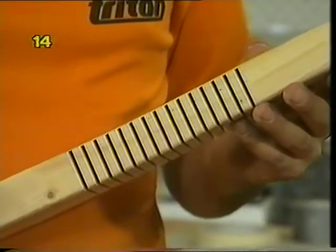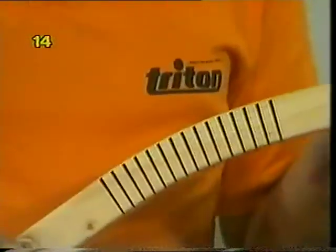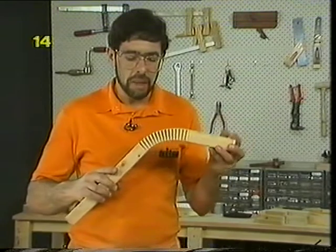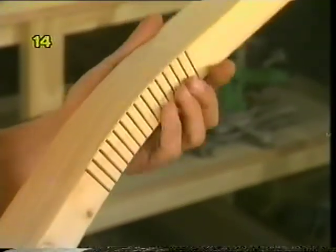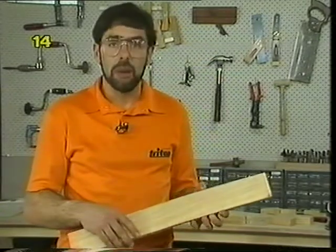This piece has been cut almost all the way through with very little material left, so it's very easy to bend. If you leave a thicker amount connecting, take good care in bending — flex a little way and leave it there, tie it in position if you wish, bend it a bit more, tie it in that new position, and give the wood fibres a chance to accustom themselves to their new configuration. If you've left quite a bit of material connecting, experiment by playing some steam on the face that's going to be bending, or try some hot water — but do not immerse the whole thing in water as it will swell up and ruin the piece.